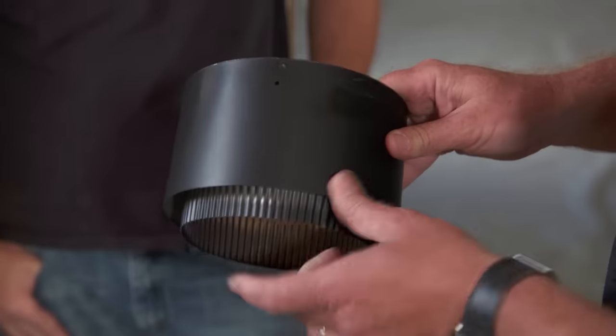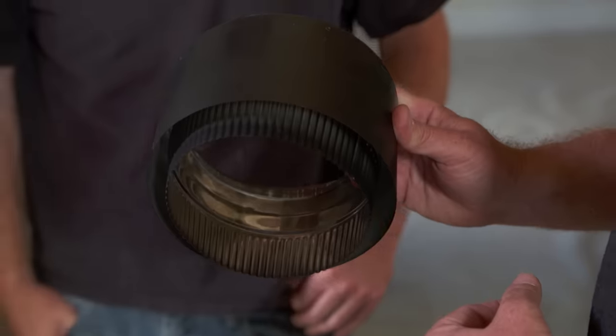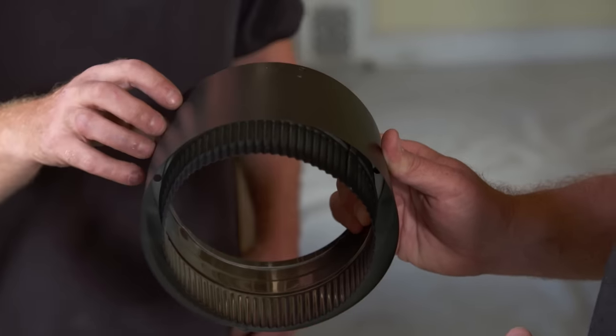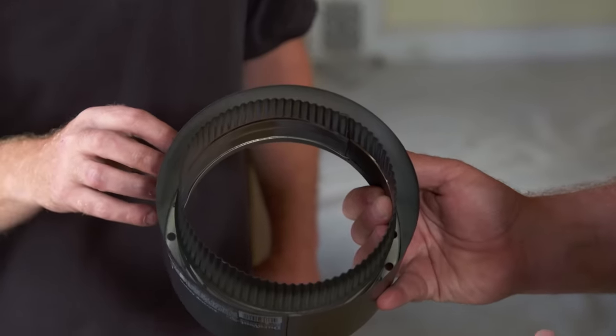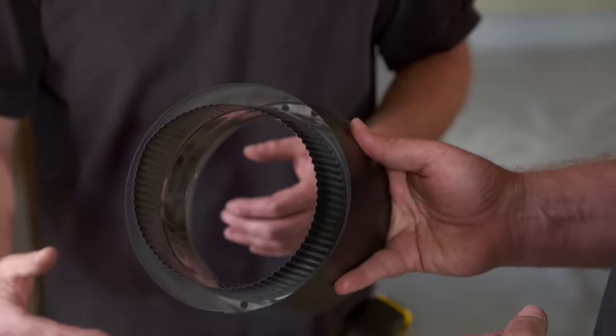Essentially, we're running from the second floor up through the roof with the insulated pipe. So when I see a wood-burning stove, I usually think of a pipe like this painted black coming right out of the stove. So what we have here is an air-cooled 6-inch stove pipe — a little different from the chimney pipe. This will be our connector from the stove into the chimney itself, so this is actually going to be downstairs on the first floor. Why not use this all the way through? So with the air-cooled chimney stove pipe, it's not listed or tested to penetrate through a floor or an unoccupied space.